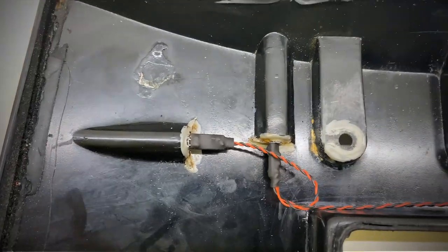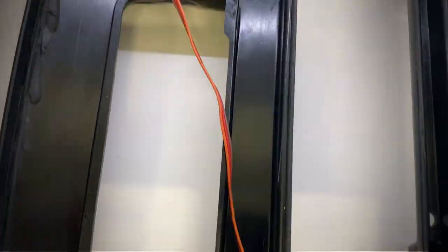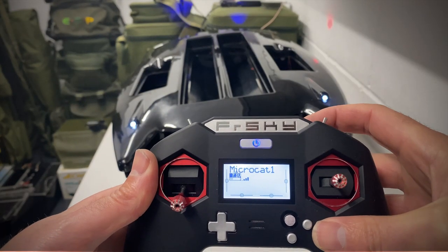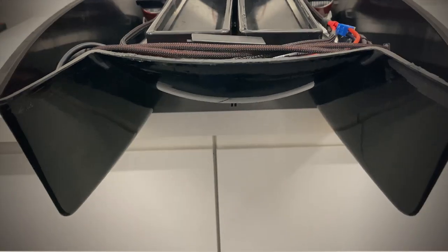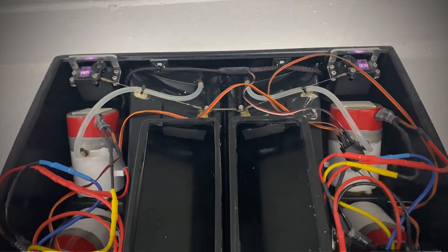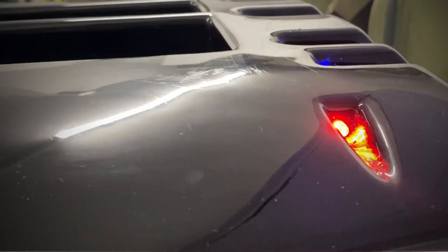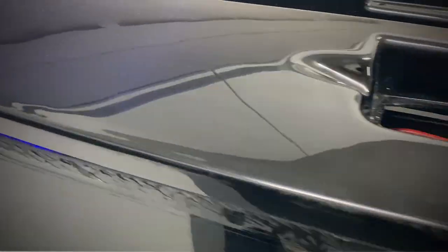The LEDs were push fit into place on the boat lid and will be hot glued in place when I finish the boat. The dimmer switch was then plugged into channel 6 on the receiver and an output was configured in OpenTX to enable one of the potentiometers to control the dimmer switch. So here it is all wired up and ready to go. I will be tidying up some of the wiring before I put the boat back together, but you could effectively use the boat now. You'll just need some 4S LiPos to fit in the standard angling techniques battery compartments and you'll be good to go.